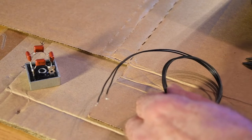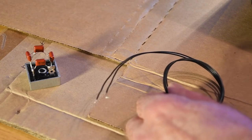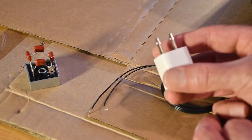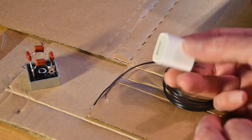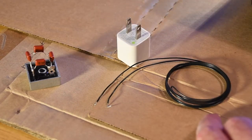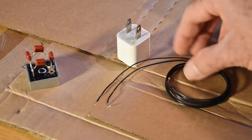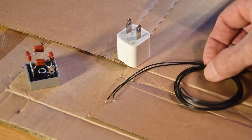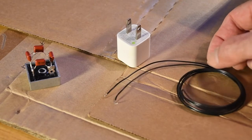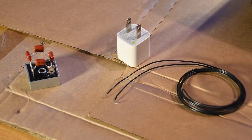Watts Abundant supplies this coil of black wire to feed the DC protection circuit — it's very skinny single-conductor wire that's going to feed 120 volts into the DC protection circuit. I thought that was awfully skinny stuff to be running at such high voltage, but apparently the current draw is not that great. It's all about current draw more than voltage, and I did confirm with them that it's fine to use what they send.